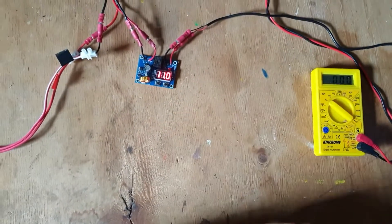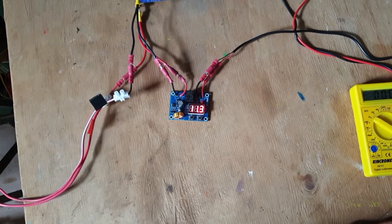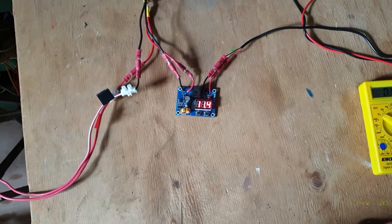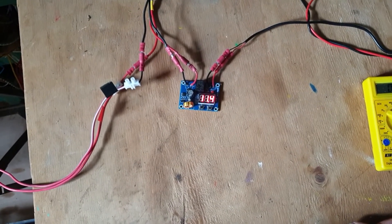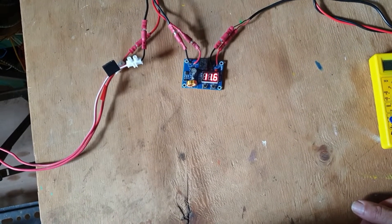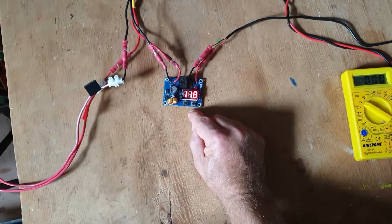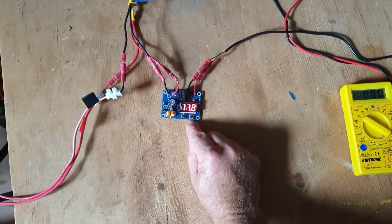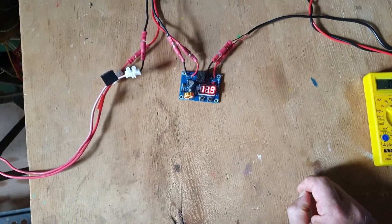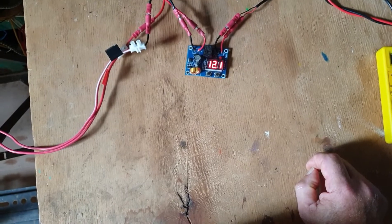What I've tried to do is a real-life application. I've got my load as a little solar pump — a 5 watt solar pump. I don't want that to switch on when the voltage is below 11 volts; I want it to switch off, because I require a certain head. Below 11 volts, this unit doesn't pump the head I require, so I don't want it pumping below 11 volts because it'll just consume energy without actually pumping any water. At the moment we've got a 30 second delay on this unit. Once it gets to 12 volts, it won't switch on straight away. We can adjust that delay right down to zero. So it's got to 12 volts and it'll take a little while for the unit to actually switch on.